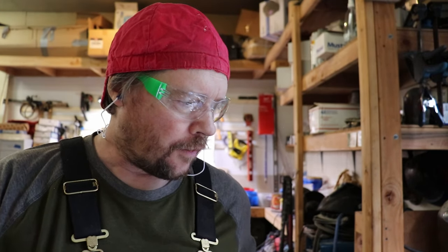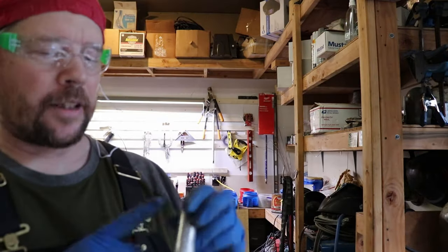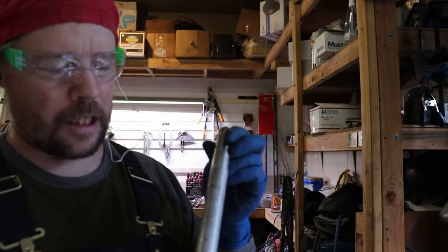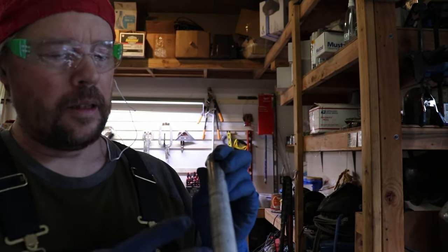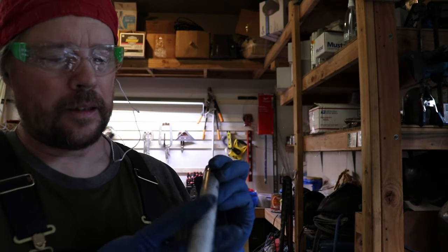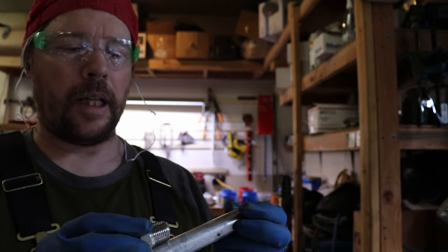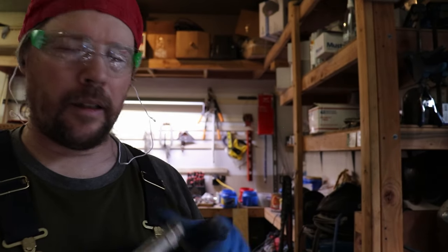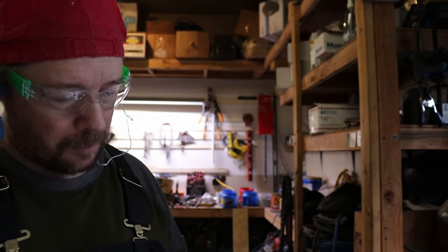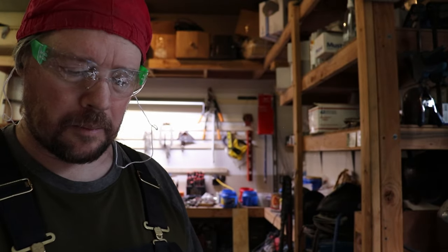But first I'm going to go ahead and get these kind of fabbed up. I'll probably just tack these pipes in, take it down to the boat, take a look at it, see if I like it or not, and then break the tack loose, cut them to length, put on the fitting here, weld it up while it's easy to do, and then I'll glue them into the plate. And yeah, it's coming right along.